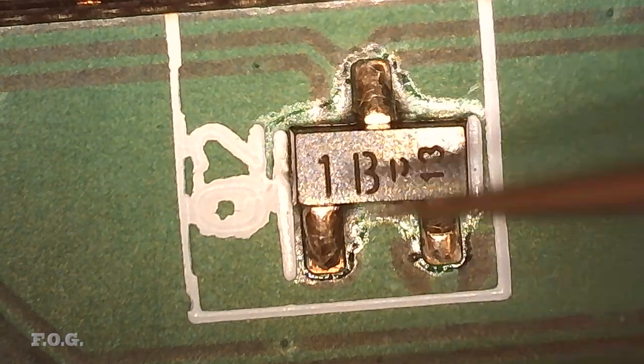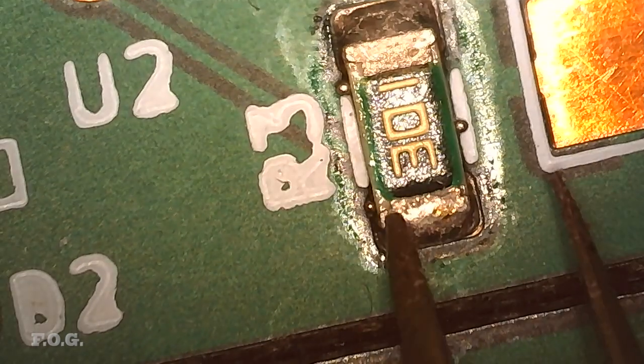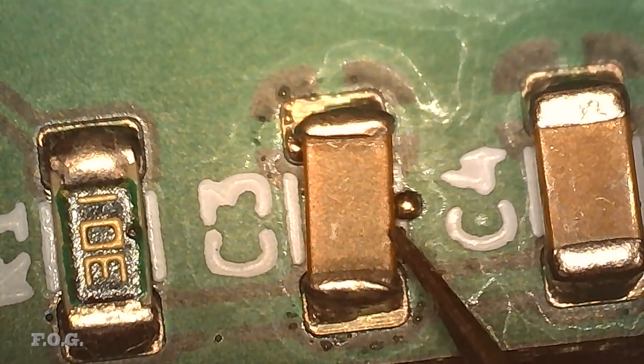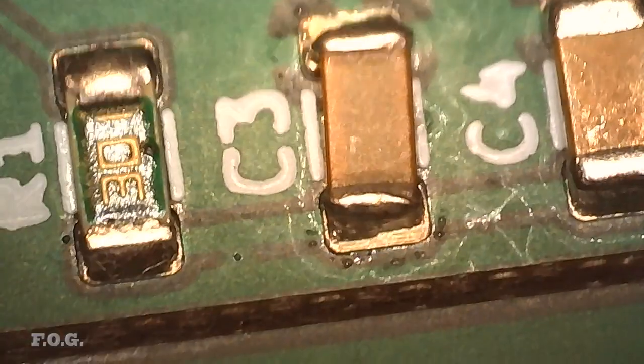I did notice that this solder paste does leave a few little solder beads here and there, and sometimes they're not so easy to clean off. I'm planning to try a different solder paste next time, 183 degree instead of 138 degree. With any luck, the behaviour will be a little bit different in this regard. And as you can see here, the capacitor has floated off a little bit out of position. So hopefully when we get the red glue, that's going to solve that too.